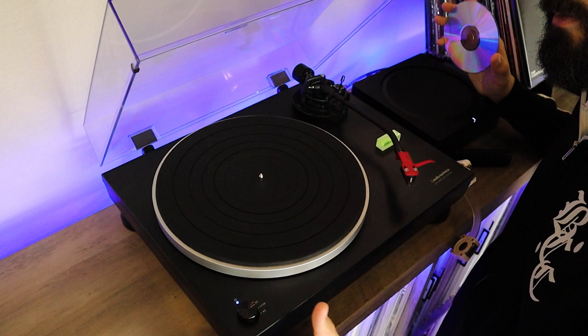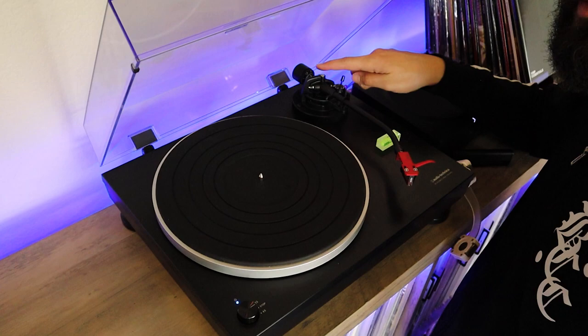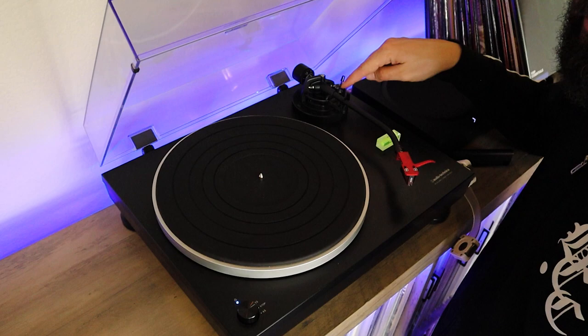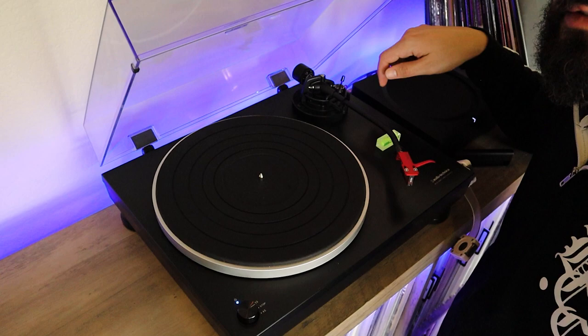So now we're in front of my turntable. This is the Audio-Technica LP5. You'll see here, this is your tonearm weight — this goes from zero to 3.6 grams on my turntable. On the right-hand side, we have our anti-skating adjustments, which go from zero to three and basically reflect what's on your weight. The Ortofon 2M Red recommends 1.8 grams of tracking force, so I have my weight set to 1.8 and my anti-skating settings set to 1.8.